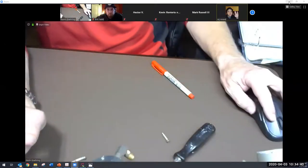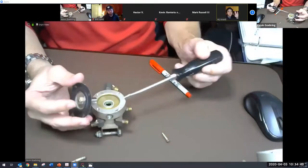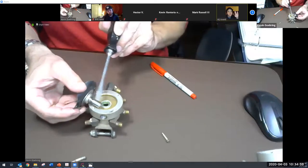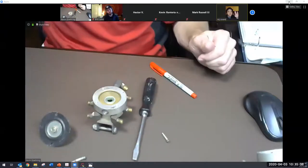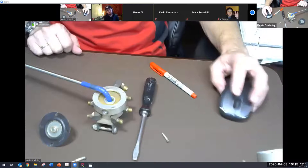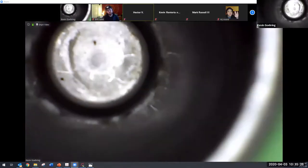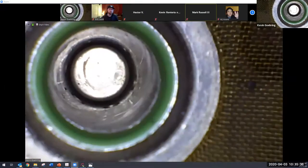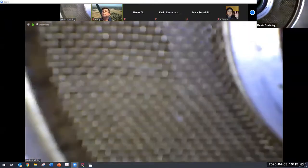So Kevin — it goes through the big poppet first, then the small poppet. Fuel goes in through here, up through the screen, lifts the big diaphragm up, then goes into that little hole right there down the center and out to where the nozzles are. Can we see inside that hole? The focal length isn't quite right, but can you see the holes on the sides? There we go — that looks good.